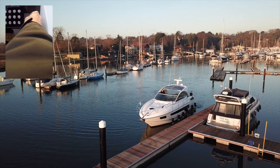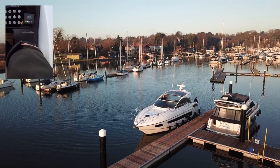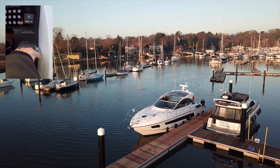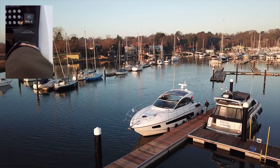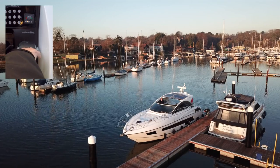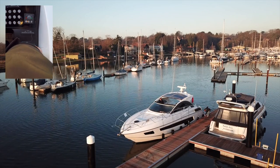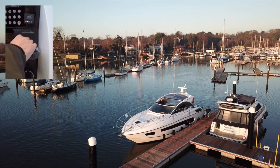A bow thrust out a little bit because that's bringing that stern in — just letting the boat gently roll in. Here she comes, just stopping her there. We're actually a fraction stern of where I want, so one little click ahead, stop on my transit. You'll see the bow's out a little bit — that's fine. Stop the boat, ready with the bow thruster. At the moment the bow is deliberately too far out.